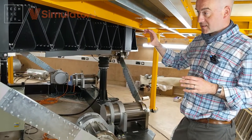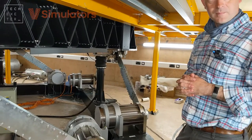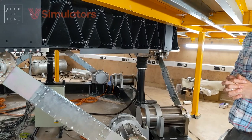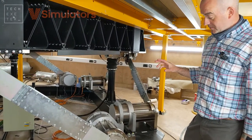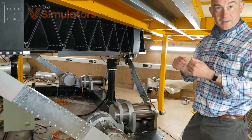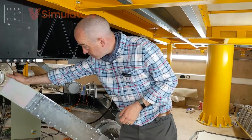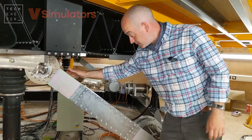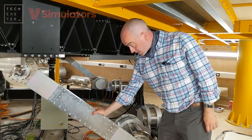This is relatively small mass and really low, but very accurate — I can definitely attest to the accuracy because it feels just like the real thing. That was a really important consideration in design: we had to make sure that when we hit the end of the stroke and did the return, there was no backlash, which you would have got with hydraulic or pneumatic systems. All the joints and bearings were designed specifically for this application, and it's in tension at all times with these preloaded elements here.